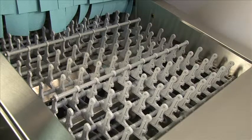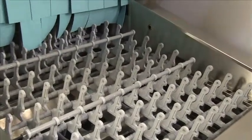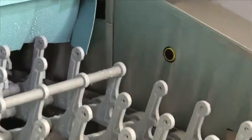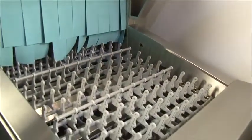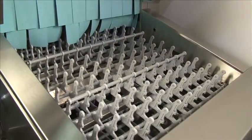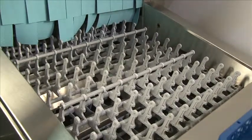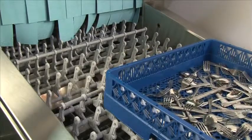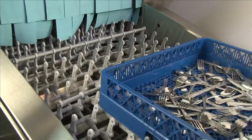When it's time to load the dishwasher, at the load end of the dish machine, the electronic eyes will pick up any ware or racks and automatically start the pumps and motors. When you're ready to load the machine, make sure your start button is on. Before any ware is put inside the machine, make sure it's thoroughly pre-rinsed with warm water to get any major debris off. We always recommend starting with your silverware and glassware and cups to get the cleanest possible results. When loading silverware, do not load more than an inch deep so the water can accurately reach each piece.